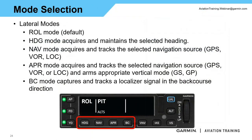Now we're going to jump into lateral modes — those are all down at the bottom of the GMC-605. Roll mode is the default when you turn the AP on without pressing any other buttons — it commands the autopilot to wings level. If I were to press any lateral mode button twice, it will default back to a roll mode. It's a 'dumb mode' — not following a heading bug or nav guidance, simply keeping wings level. The heading mode follows your selected heading bug. Set your heading bug on the primary flight display or HSI, engage heading mode, and the autopilot follows that bug as you're being vectored by traffic control.